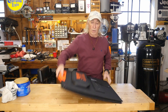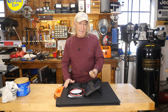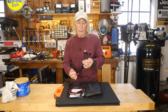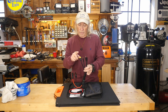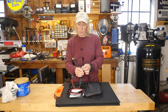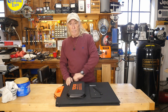These panels are heavy, so the wind is not going to blow them away. When you set them up, even on a windy day, they're not going to knock over. Now the package that comes with this 200 watt solar panel is pretty much the best setup you're going to see. You've got your regular MC4 connectors with what looks like number 10 wire, plus they include a multi-kit with all the different connections you need: XT60, small DC barrel plug, a pin connector, and Anderson cable — all 30-amp rated.